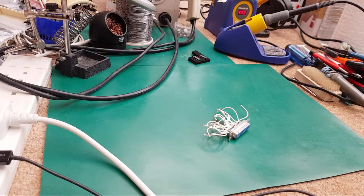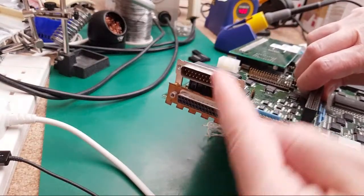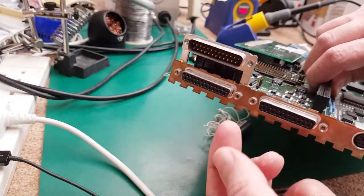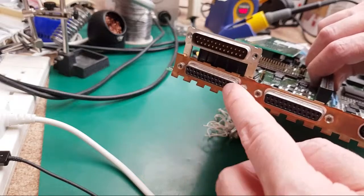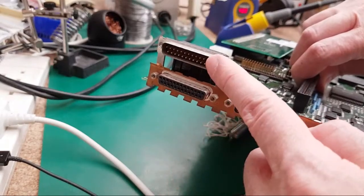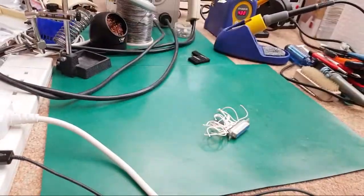Mike Simcox, 1.21 gigawatts down the 5 volt rail. Yeah, that's probably what's happened to that serial port. I think the thing with the serial ports as well is these pins, isn't it? I'll bring that board back in a minute to show you what I mean. You've got the pins exposed here. So if you just shove your finger in there, you can damage that with ESD. But try and ESD damage one of these here. You can still, in theory, do it because it can fly off of you into the pin that's in the thing there. But these are a lot less sensitive than something like that. Very easy to prod that, putting your fingers around the back, trying to get to a cable or something. It's the same with the video connection there, but anyway, that's that.